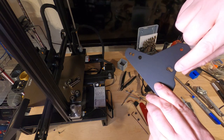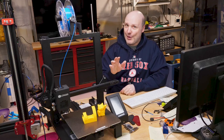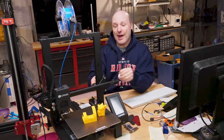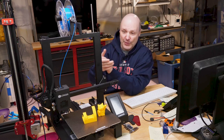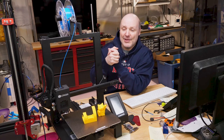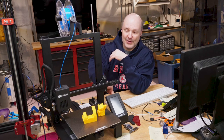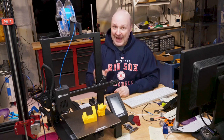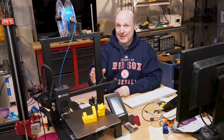Once I did a little bit of drilling and tweaking, everything lines up. So you're probably thinking to yourself, was it worth it? Well, it was a lot of work. As we put this together, everything's lining up — the screws are parallel to where they're supposed to be. As the V-slot wheels are going on and we're tightening up the eccentric nut, that's fine. This one's wiggly again — it's not free spinning, but it's definitely got some spin to it. That's a little frustrating. But now we have a lead screw and another motor holding things in place.